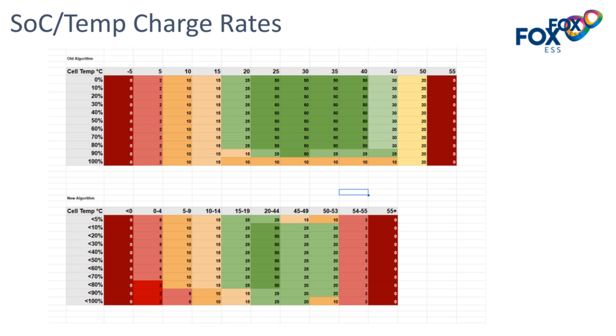This is the algorithm the BMS has set — there are some edge cases, but as a general rule from what I've seen of people posting questions about various battery behaviors, it tends to fall in this new algorithm area. Obviously during spring, summer, and autumn you don't notice any issues. For most of the UK's climate you're somewhere between 15 and 25°C, which means you're typically able to achieve top performance of your battery pack. But the moment you start to dip under 10°C battery temperature, you start to potentially half the current, and de-rating kicks in.